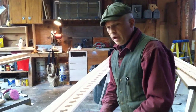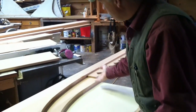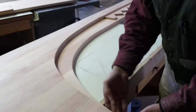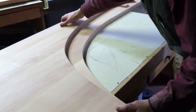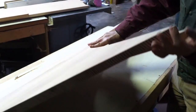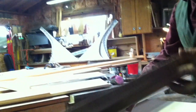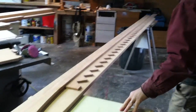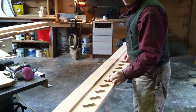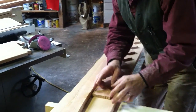We've put together all these components for this historic restoration fascia piece that we're doing here in the shop. And I want to point out a couple of things before we start our final assembly. You've seen that we've cut out all the radius work here. Everything's been sanded and put together, glued together, molded together. You can see perhaps in the back what this looks like. Okay, so we're going to have a soffit piece that comes down into here, so everything's molded together, and this back piece will be primed as well as the face. All sides will be primed before it goes in. But what's interesting is we're doing this little sawtooth component here to match existing, and we're going to get this lined up next so we can start doing our radius work.